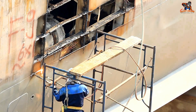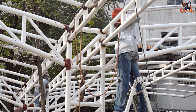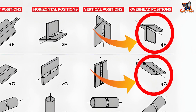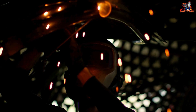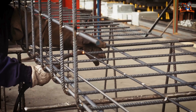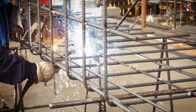The vertical position (3F/3G) is even more skillful because you are welding on a vertical wall while gravity pulls the molten metal down, requiring good technique to fight this force. The overhead position (4F/4G) is the most difficult, involving welding above one's head where gravity makes the molten metal drip, demanding higher skills to be done safely and effectively.